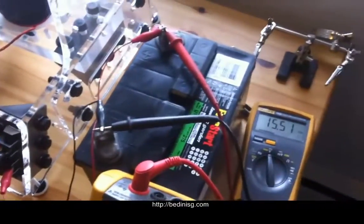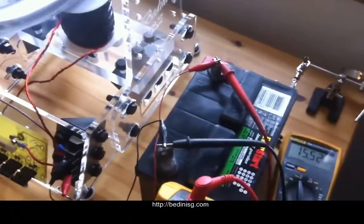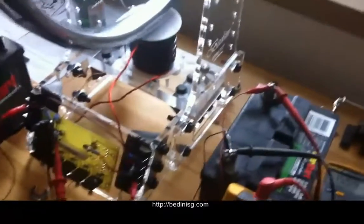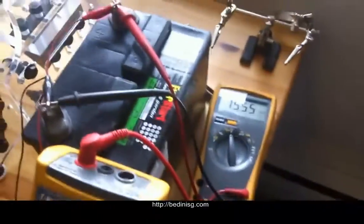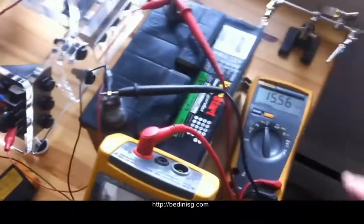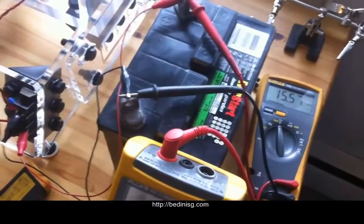These batteries are quite a few years old. I actually brought these down to zero volts and shorted them because they wouldn't even hold a charge. I was using the 2A12 to charge and put it through a cycle on the Western Mountain Radio load tester to draw it down, then charged it up and rejuvenated them pretty well. For something I brought down to zero volts and shorted out, it's pretty incredible — it can get up to better than new capacity.